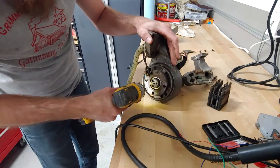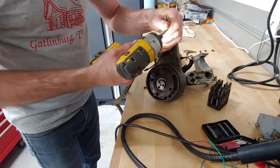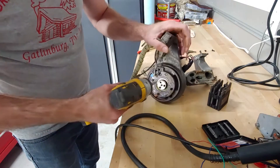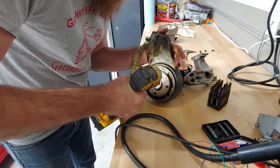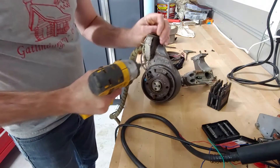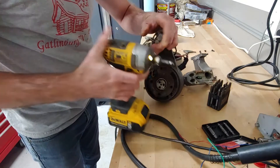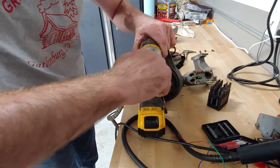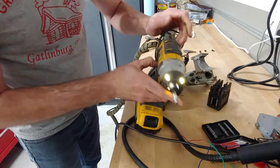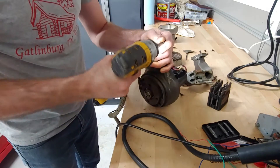So that one didn't work. Let's try this one — this is gonna need to be drilled out a little bit. The secret to these guys is always keep the thing in reverse. This is a left-handed drill bit on one side and a screw extractor on the other. Get a little more for it to bite into, flip this guy around, pop it in there. These cheapo things are a little weird — and there we go, easy as that.